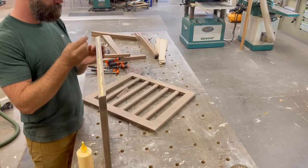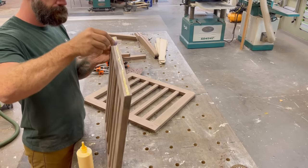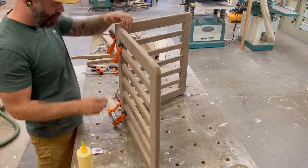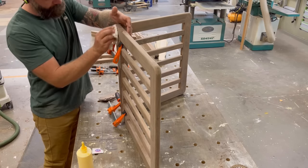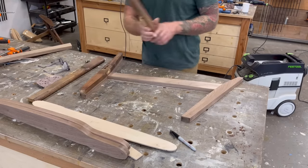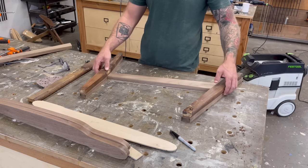Then it was time to glue my upper and lower seat frame assembly together. Because this is at an angle, I didn't want it to slide around when I tried to clamp it up. I didn't have any salt in my shop, but I did find a packet of sugar. So I just sprinkled it on top of the glue — what this does is add a little grit so that when you clamp up your angle, it doesn't want to slide because it catches on the grits of that sugar. It actually works pretty well. With that thing in clamps, I set it aside and it was time to start working on the joinery for all the pieces I templated out yesterday on my base assembly.